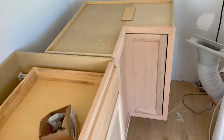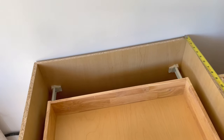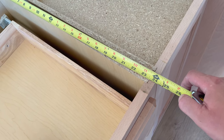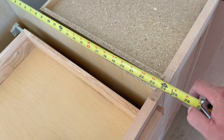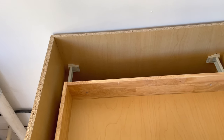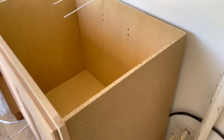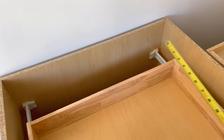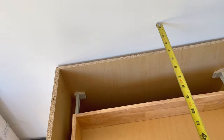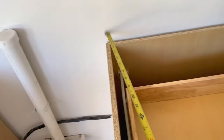It said it came 36 but it really came 28 and a half. I know my butcher block is 25 inches and this base cabinet is 24 by 24, so you can see it sits at about 24 and a quarter. Everything is going to line up with your tallest cabinet that comes off the wall the most. I'll pre-fit all these in here and then put little pieces of wood back here to make sure it's tied up on it. I can see my stud right here, so I'm going to put about three to five screws all the way up, and fit it out so this is tight to the wall.